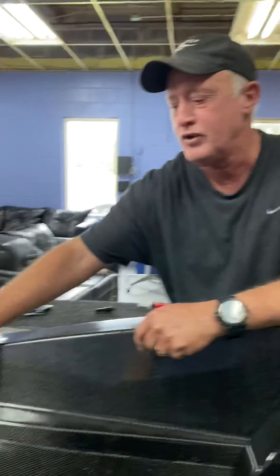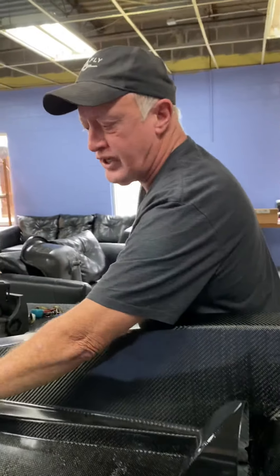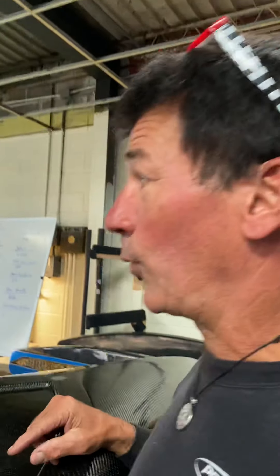Some of the other things we were able to work out today: to help minimize the time it takes to put the boat together and minimize cost and weight. On the tracks, we went through several thoughts and came up with rivets with washers behind them, with additional reinforcement carbon underneath. While the deck was still off, we sealed those and carboned and glassed over them so they can't allow any water to penetrate through. That's 64 rivets in there. Based on the performance we've got from the rivets, we decided we can take every other one out — reduce that in half and cut the weight in half further. So we're going to see rivet, empty space, rivet, empty space. Why the empty spaces? Because it's not needed for strength.